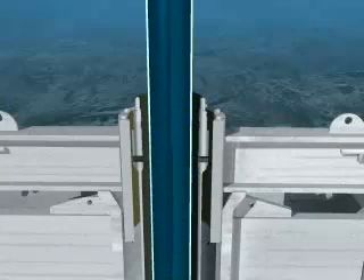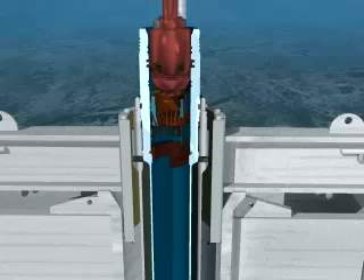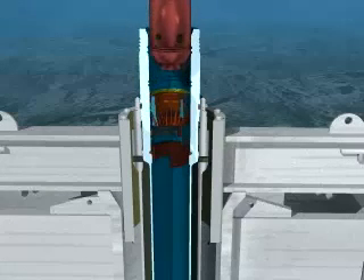In the event of shallow drilling hazards such as gas, a small pilot hole may be drilled first. Should shallow gas be detected, well-defined contingency plans are enacted to ensure safety on the drilling vessel. If a small pilot hole has been drilled to casing depth, a hole opening assembly would then be used to increase the size of the well bore to allow for the installation of the conductor pipe.